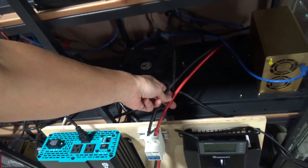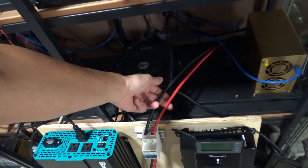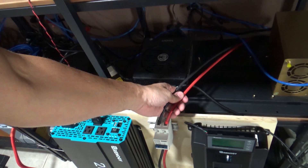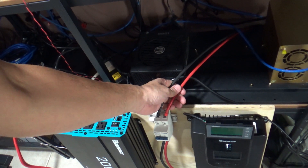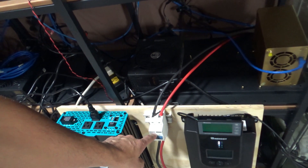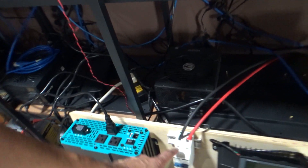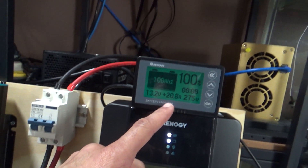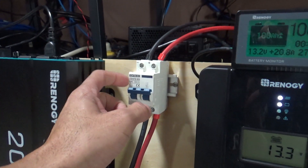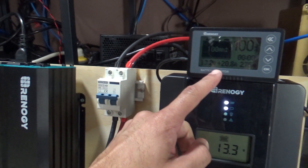With the other two panels I actually have the 8-gauge cable, but this one still has the 10-gauge going towards the four panels — those are using the 8-gauge cables. Let me check if this is hot. Right now this can handle 40 amps, but it's currently only bringing in 20 amps, so it's a little bit warm but it can handle it.